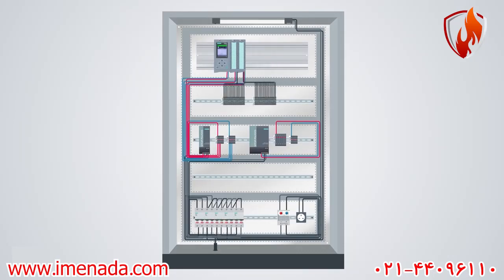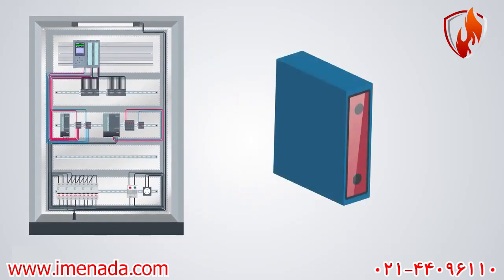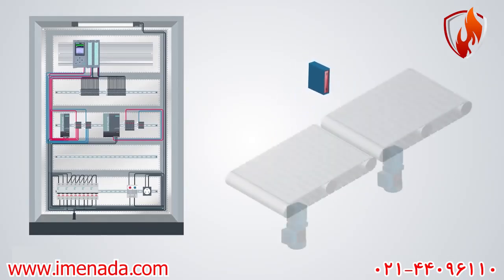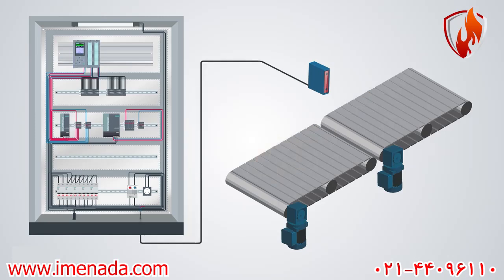Now, let's have a brief overview of how to connect the sensor to our control panel. Take this photoelectric sensor as an example that is installed adjacent to the conveyor and is supposed to recognize the boxes that are passing by on the conveyor. As this sensor requires power to operate, I'll connect the 24 volts to that from the second power supply's terminal box.